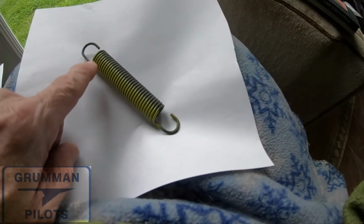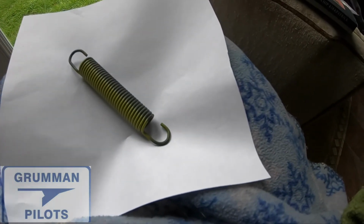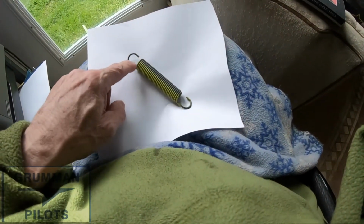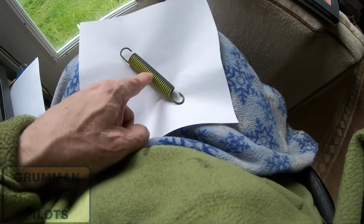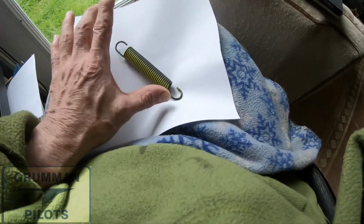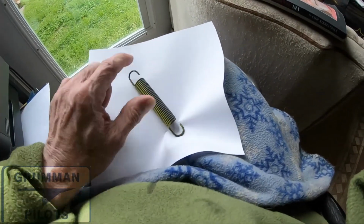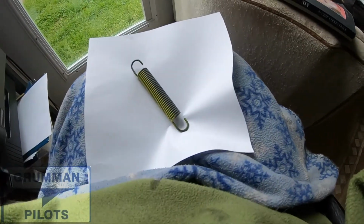Then you also have to look at that's when they have the proper wire. So it's of the right composition, it has all the right properties. Now you have to take that wire, and it has to go on a machine, and you have to specify how many turns per inch you're going to make, what the length of the spring is going to be, what the tension of the spring is going to be, what the spring pull on it is going to be. Finally, after that spring is made and it's on a machine, they'll run 1,000 at a time.